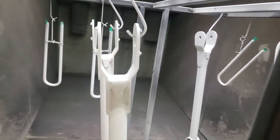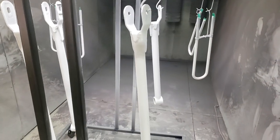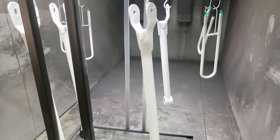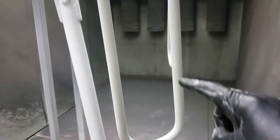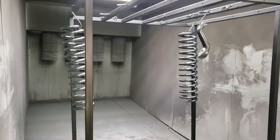It's worked in the past. So that's our next step. We're gonna get that in the oven and take care of the back ionization issue, and then we'll hit it again real quick just to make sure we don't have any of those dots appearing in our clear.